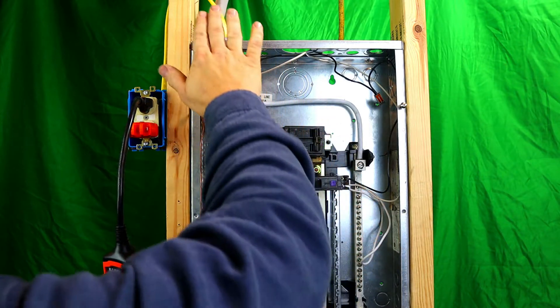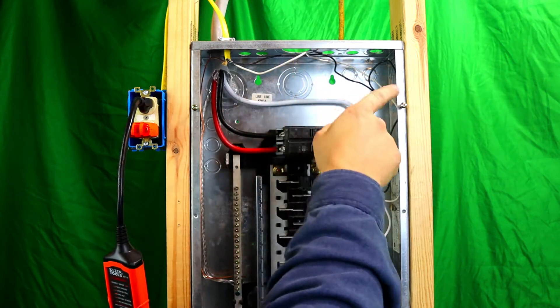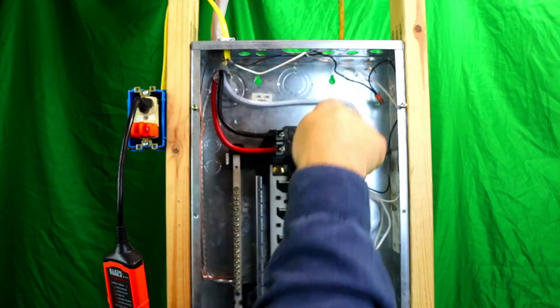That's the gist of how to hook up your arc fault GFI combo — it's super easy. Wherever you run your home run, keep your hot and neutral together, and don't put your neutrals from the receptacles onto the neutral bar lugs; put them onto your breaker. To summarize my opinion on arc fault breakers: at first I wasn't a fan because when we first had to install them, ceiling fans would trip them immediately, old answering machines with tapes would trip them, and oscillating desk fans would trip them. They're a lot better now and don't do that, at least in my experience.